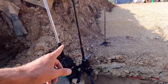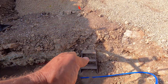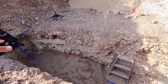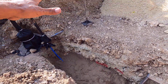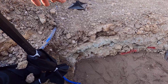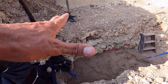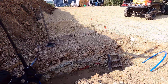I've got the yard hydrant in, the curb stop, and my line running to the other side of the trench. The next time I work on this, I need to know exactly where the hydrant goes on this side — it's a shorter version of that one and it's going to come up inside the building. Once I get that hydrant in, I'm going to fill this trench to that red line, tamp it, get the sand moist and packed in. Then I'm going to put two layers of styrofoam over the top, and cut a piece of styrofoam to make a kind of wall. The stuff on the bottom stops right where that wall starts, then I'll fill the back area with sand for vertical protection for these pipes. As the wall is being put in, I'll put two-inch insulation behind the wall as well. All of this should be just fine as far as freezing goes.